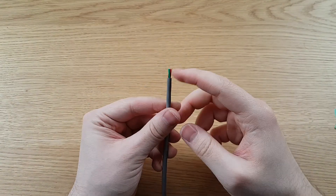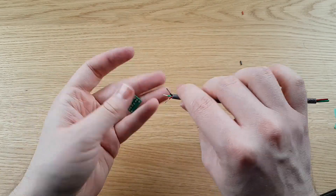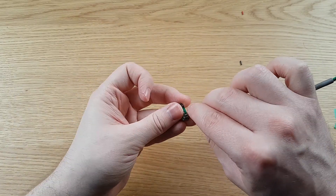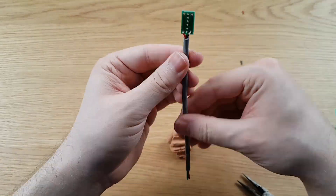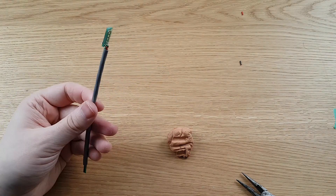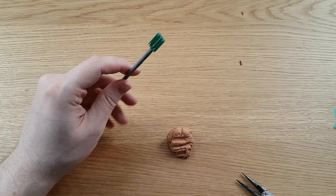Now we're going to take one of these wires and connect it to one of these little circuit boards. Once these are all soldered, I've got some silicone conformal coating that we'll be putting on all of the connections so that these don't hopefully corrode outside on the house. I'm going to go through and make up a bunch more of these, then connect them together and solder on the LEDs. I'll just do a time-lapse using my webcam that I have set up.